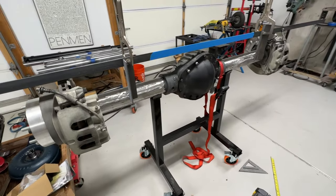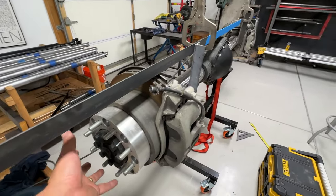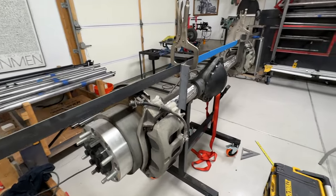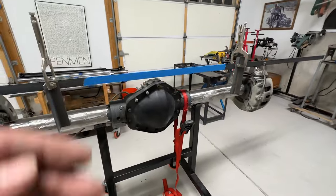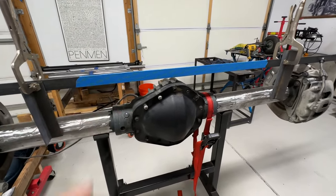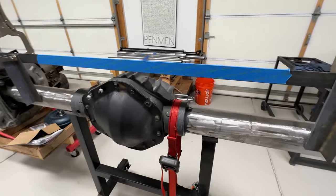It is time to get to the 14-bolt. We got a lot going on with this thing. A few of the simple mods we put on it are just some spacers — this sets the tire out about two inches on each side. It also changes the bolt pattern such that Lefty and Honcho, both of our race trucks, have the same bolt pattern in case we need to swap tires during the race. In the next episode we're putting in a spool and changing the gears from 3.73s to 5.38s, really giving us better gearing for the 40-inch tires.